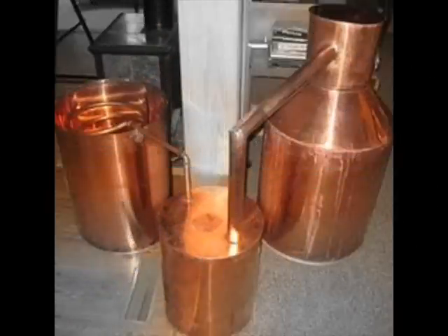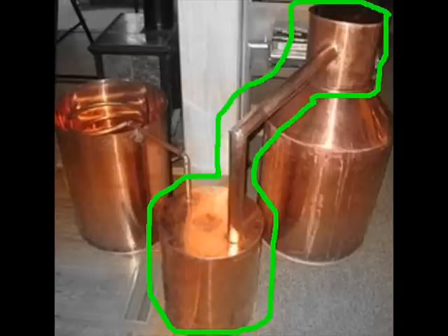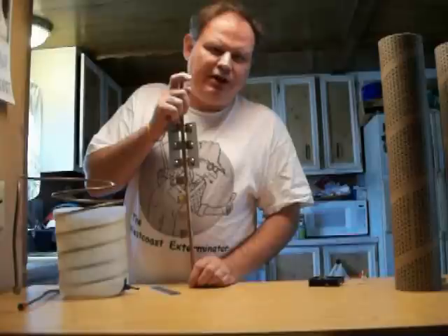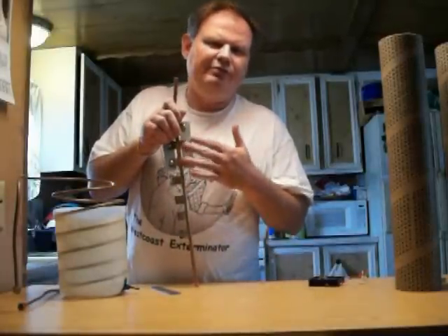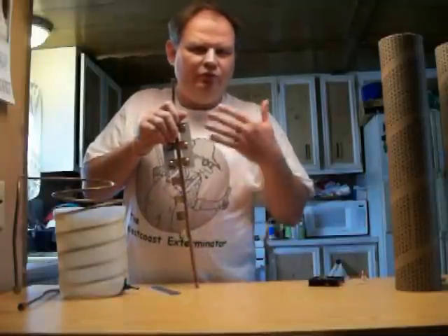Let's try one more. Does this still have a reflux column or a thump keg on it? It's a trick question. While the still does have a thump keg on it, if the thump keg were dry, being that everything is made out of copper, it would all act as a reflux column because it would allow heat to dissipate into the air, much as a reflux column would do. You could run it dry, and you could also put extra cooling fins all over the thump keg and the head of the cook pot and it would act just like a reflux column. I hope this teaches you a lot more about reflux columns and thumper kegs, and I suspect you're going to see a lot of changes in future reflux columns on stills that you can buy, knowing this information now.